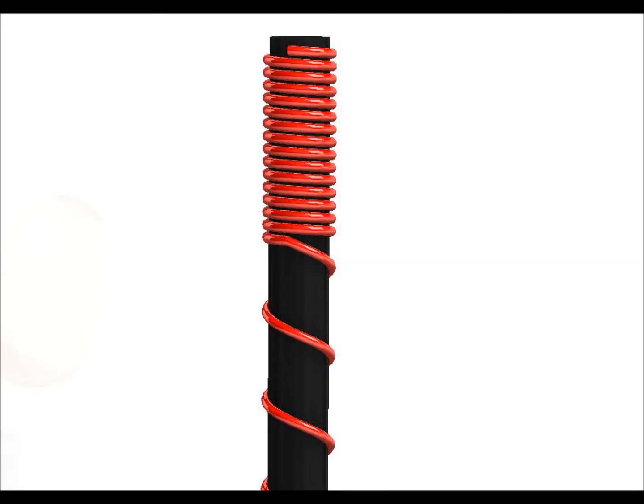I find that I've got a good SWR at around about 14 turns. You can hold the top part in place by taping it whilst doing the experimental SWR stage, or you could drill a little hole about half an inch — 12mm — into the top just to hold it there. Best thing to do when SWR-ing it in is to try on low power to start with, just in case you're getting high readings — you don't want to damage the output stage of the radio. I found I was quite close to start with without having to do much messing about. Advise low power first, then turn it back up to your standard 4 watts output for the final test to ensure you're getting the full and correct reading.